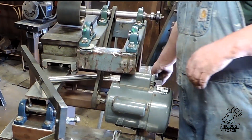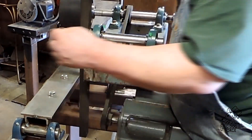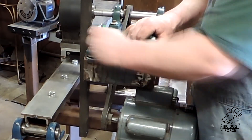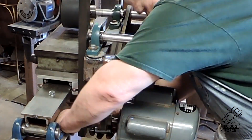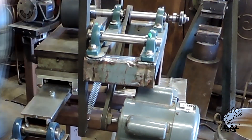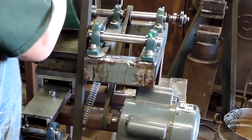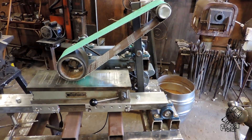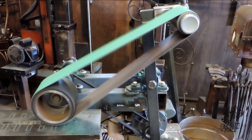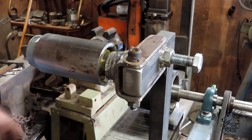You're going to notice that I have that motor sort of mounted and it's a little crooked — it's just a temporary mount because I'm not convinced that those pillow block bearings are going to handle that constant contact wheel very well. So we're keeping things a little bit loose to begin with. We're going to get our tension spring on the bottom of that pivot arm. Let's get a belt on this thing and see what she looks like. The tension arm with our axle hub looks good and seems to work really well, and there's enough tension on the spring for the belt — but you can see the vibration in that belt. This thing is just making a horrific growling noise and it's all coming from those pillow block bearings.